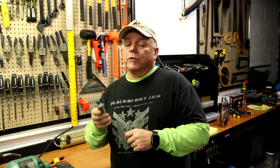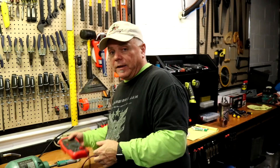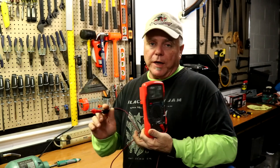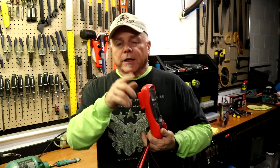We also used a non-contact circuit checker — this tests for the presence of voltage without touching. It's great for finding a hot wire, like in a ceiling light when I wired these fluorescent fixtures. I was able to isolate the actual hot wire with this thing. And this one has the plug-in tester built into the end of it. Lastly, we used an actual meter which told us the presence of voltage — we read it at 122.5 volts. That tells us we have a good ground and that neutral and ground are bonded together, actually tied together at the breaker box on a three-wire service entrance.